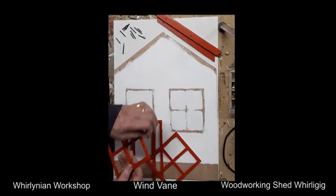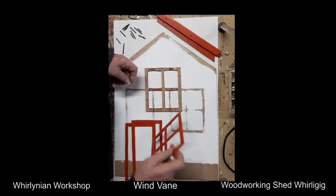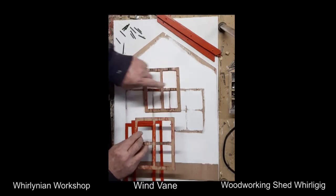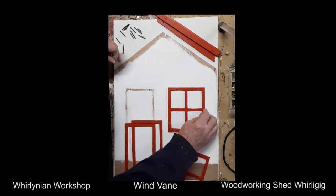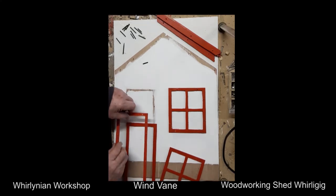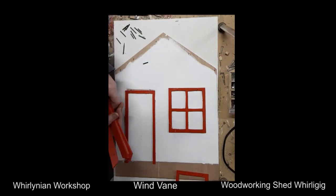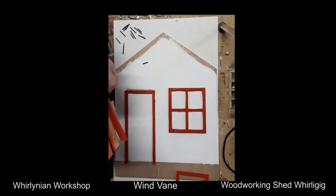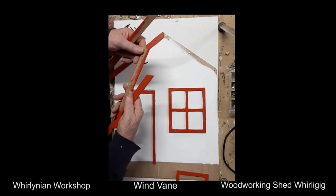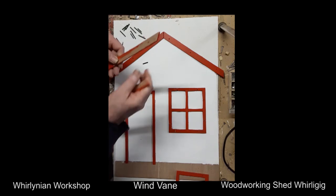When I made these pieces, I marked which one was which and noted the position on the vane — for example, marking corresponding pieces with an X so I know which piece goes in which location. I did this for all the pieces on both sides of the vane, numbering them as needed so each one goes in the correct position.